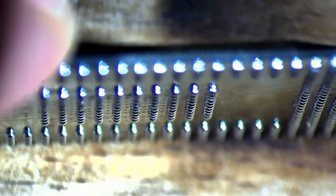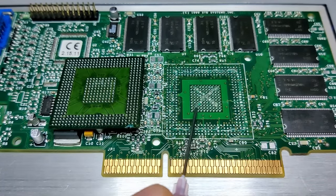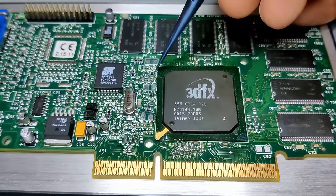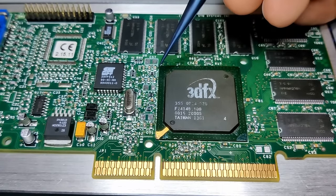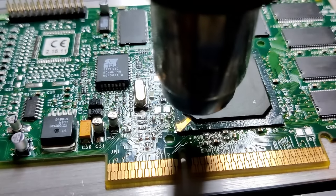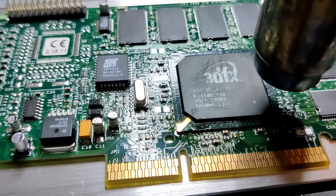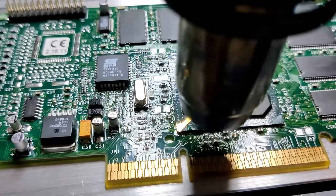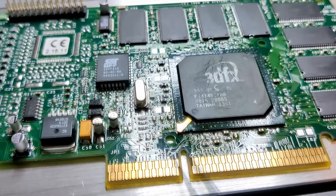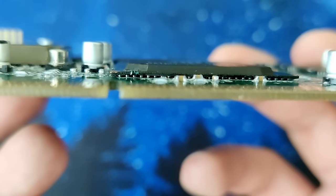I'm really proud of my first reballed chip. Now we just have to put it back on the card. I added a little bit of flux and distributed it with my finger evenly across all pads. Then it was time for the chip to go back on the card. The goal is to realign the solder balls with the pads on the board. Luckily, the board has an outline of where the chip is supposed to be. Once more I used the PCB preheater, and when the card reached temperature I started to blow hot air on the chip and waited until the chip moved into place. This took a lot longer than I thought. But at some point the chip did move and I gave it a little push on one side to see it move and go back into position. Unfortunately, I do not have this on camera because I wanted to focus on the chip's placement and that required all my attention. Once I was done, the card needed to cool down for about 5 minutes.